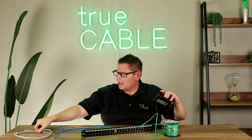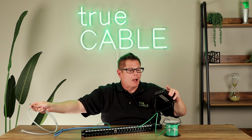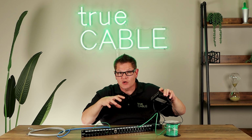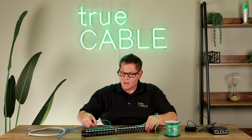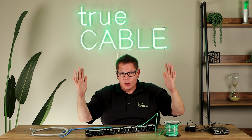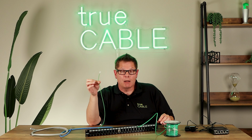Even if you were to hook up a shielded patch cord from this shielded keystone to the switch, even though the switch has metal switch ports, it's still not going to bond your cable shield and drain off any excess energy or electrostatic discharge to ground. Another problem you're going to face, for example, if you're using a shielded patch panel like this one, is that you've mounted it into your little rack frame on your wall, and then you notice that they give you this measly 12-inch long bond wire. Now, this needs to be bonded to ground somehow.